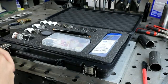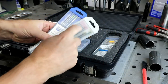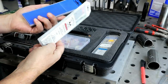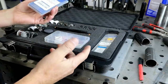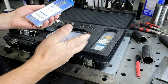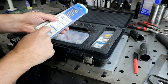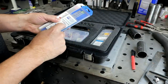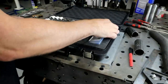There are a couple different ways we can talk about this. Obviously there are the tungsten types, most of the time associated by color. Don't get too overwhelmed with what kind of tungsten you're using. A red tungsten, or 2% thoriated tungsten, is going to be perfect for just about everybody in every application, especially when you're getting started. I personally like to use the 2% lanthanated — I think this is more specific to inverter machines. If you have a transformer-style machine, you don't want to use this. They make a ton of types now, so don't let it overwhelm you.